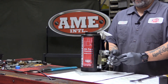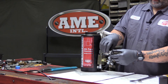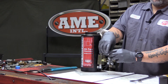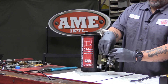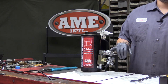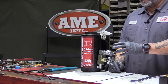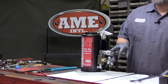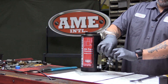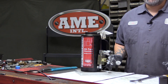The other preventative maintenance: CD411 — a little metal dust cover that attaches right to the coupler end. This is perfect for you guys out in the field; it keeps the dirt and debris out of the coupler. If you don't have this, we have plastic versions, but I highly recommend using the metal version. When you're ready to use the tool again, unscrew the coupler end — it's on a ball swivel, just let it hang straight down.